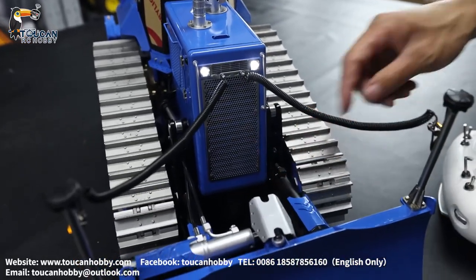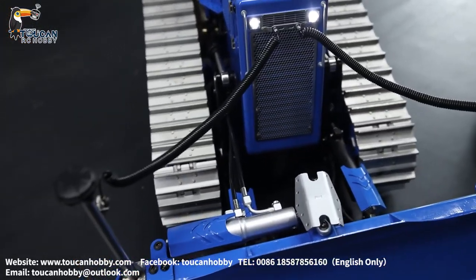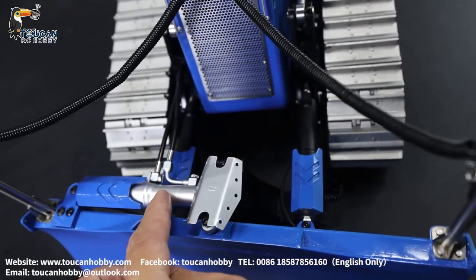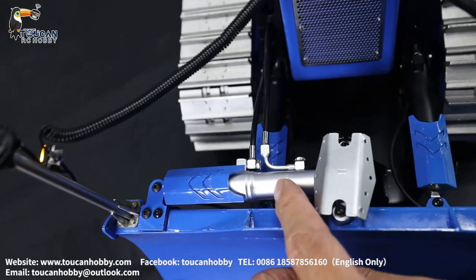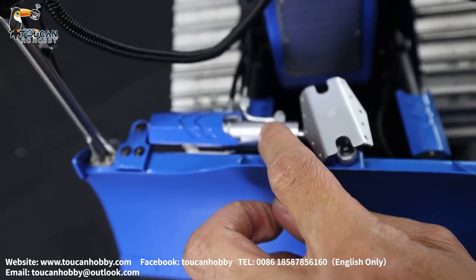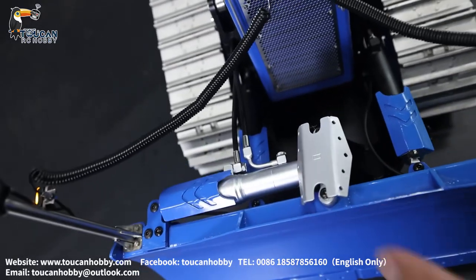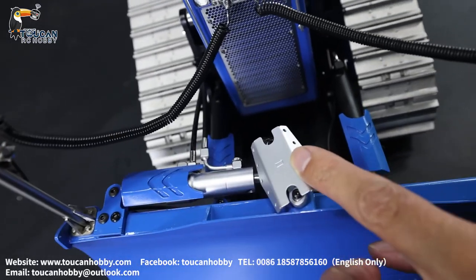On the front, these two cylinders are for the blade up and down. The two cylinders on the underside are for changing the blade angle. This cylinder here is for the bucket tilting. And this one underneath is a connecting rod for keeping balance, working with the first two cylinders.